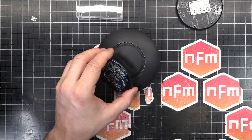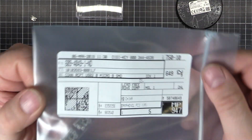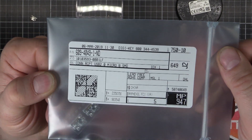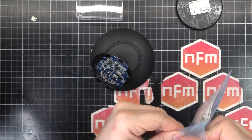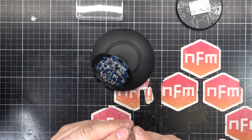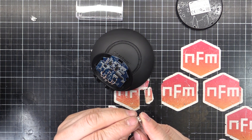That's a neat trick to desolder chips as well — you can cut the legs, take it out, and desolder them one by one, which makes it a lot easier. So I've got a new one — actually bought five new ones from Digikey. You can see the part number there. I'll also put the information down below, and that's the exact part — well, I'm hoping it's the exact part. It does match up perfectly from the drawings. So let's stick one of these in and see what happens.